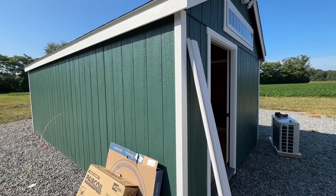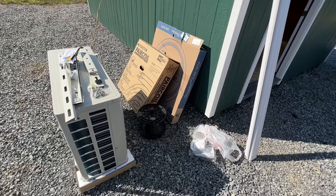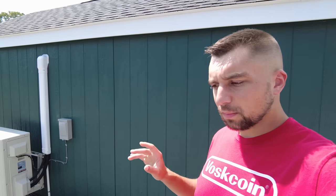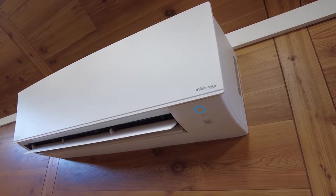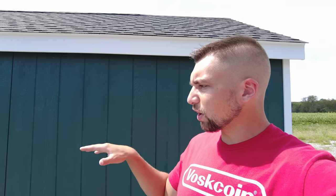Originally I made an error and I bought the wrong mini split. Long story short, as you can see, this unit - while it may look like the previous mini splits we had on here - this is called a low ambient model. Basically this can run down to negative 14 degrees. I do have to put a different grill on it, or it's maybe negative five degrees, but it can run as low as 14 degrees with the current grill. The point being that I will be able to cool with this and it won't freeze up in the winter.